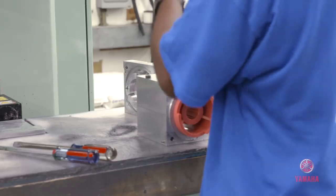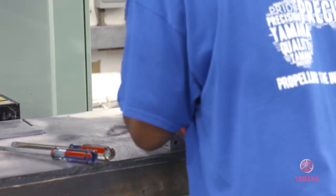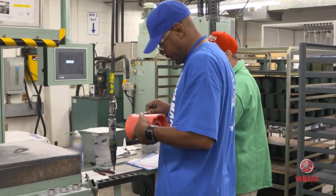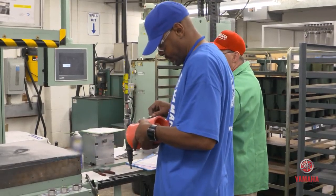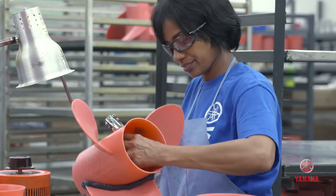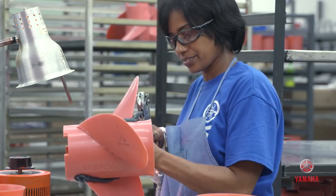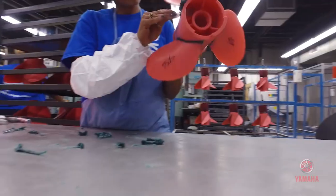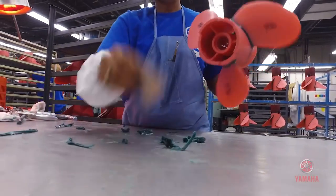The platens on top of the machine are water cooled so that we can run the wax dies at a consistent temperature. And what that does is it injects into the die like a toothpaste. The blades are then welded on — nothing more than a soldering iron. We then use an automotive goop gun with a heat exchanger on it, and we roll that material out to give it the root radius. The parts are then cleaned up and scraped off.